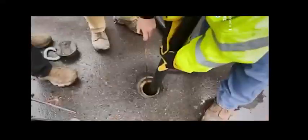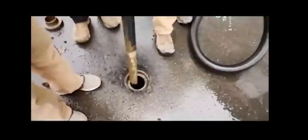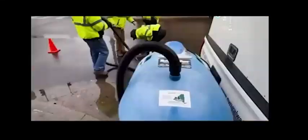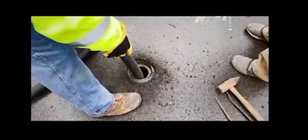We started with the aluminum head on this unit. These guys had tried to use their clamshells, but quite often the clamshells don't get everything out — if there's water involved, it rolls right out of the clamshells. They stuck the Rollin' Back in there using the 20-foot sectional line, inch-and-a-half hose, and we had this valve box cleaned out down to the valve in less than 10 minutes on our first try.